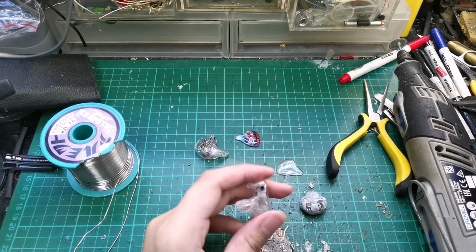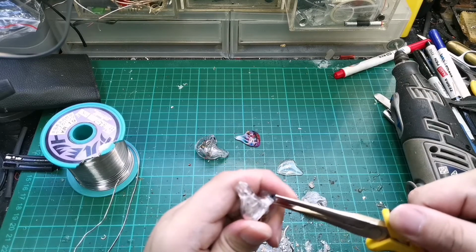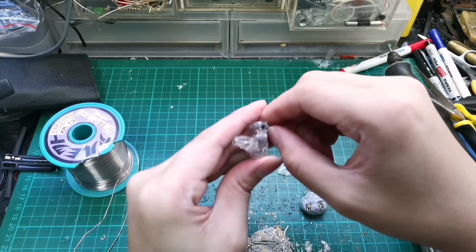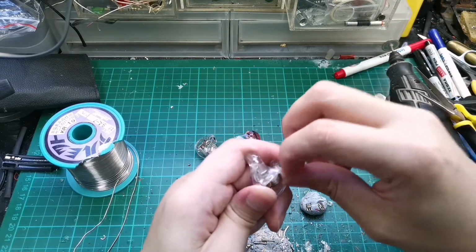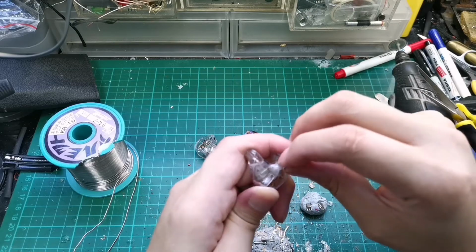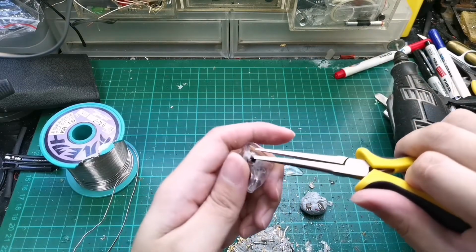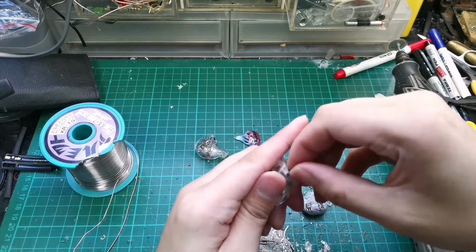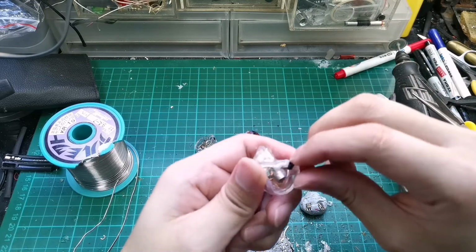Once we trim the side acrylic, we can actually remove the top, this piece of acrylic. You see, we can remove it. I don't know if the focus is very bad. Once that is removed, we can take out this IPX female connector. Now we have to remove it and solder in the new connector.